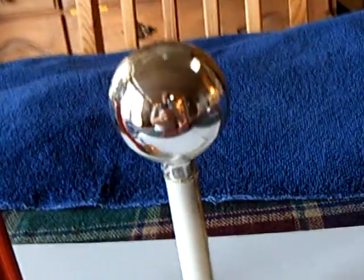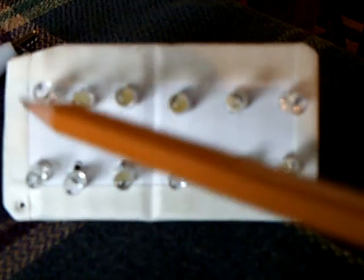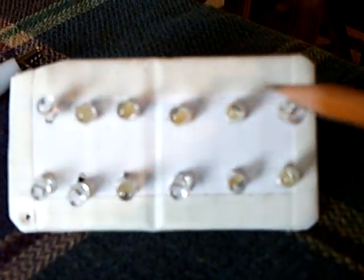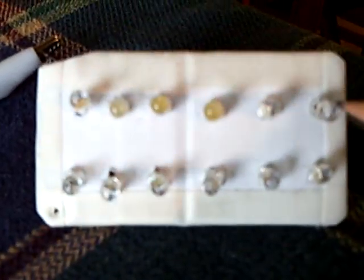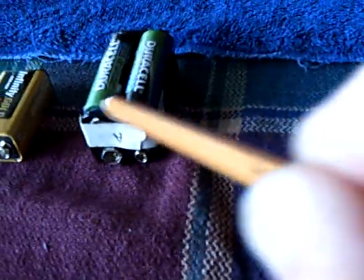It's really compact. I'm going to show wireless transmission of energy going over one wire to 12 LEDs in series. If you add up 2.5 volts times 12, that shows you the amount of voltage coming over to light these off just one wire. You can run this on a 9-volt battery like EM Devices did, or a 4-pack of AAs, but I like this little cell phone charger idea. Let me turn this on and show you how it works.